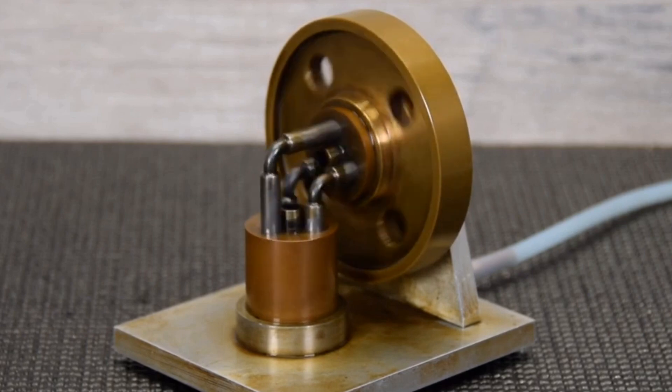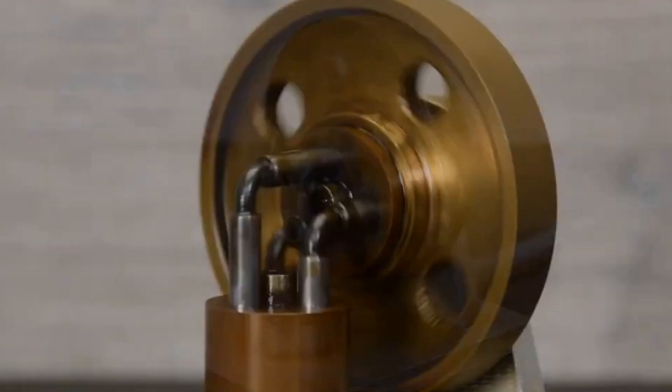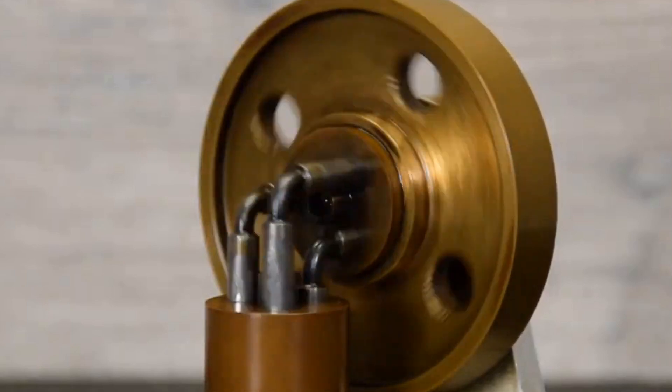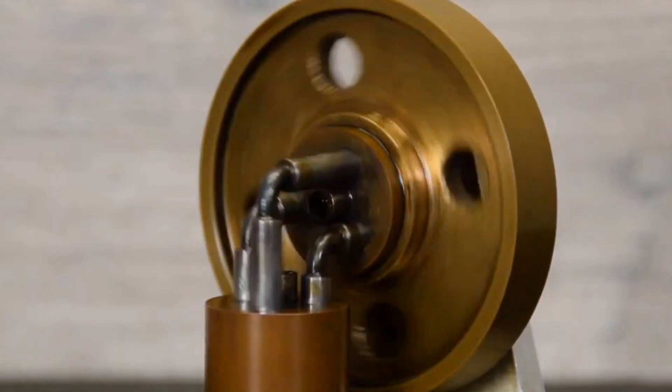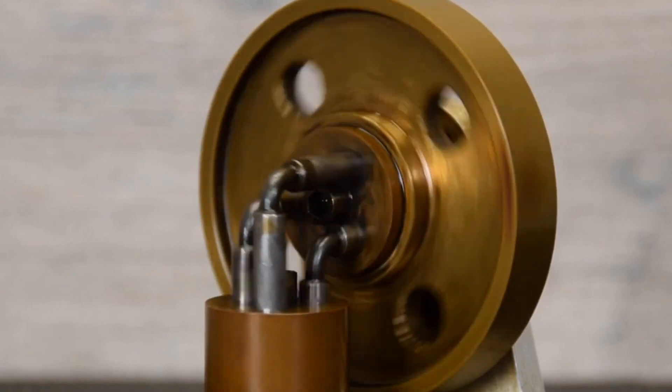One thing you can do with it is make an engine — an engine called the elbow engine. You could immediately see how you could turn that into a solenoid engine, or equally reverse that and make it a kind of generator. It's an interesting and versatile joint used in things like angled tools for reaching hard-to-reach places, but it is locked into that 90-degree rotation and there are issues with it. Unless you get it lined up exactly it will shudder and jump, but if you line it up it's going to be absolutely beautiful and capable of handling a great deal of torque. That idea of turning it into an engine is very attractive — try turning a couple of bevel gears into an engine; good luck with that.